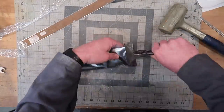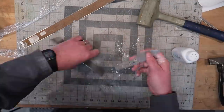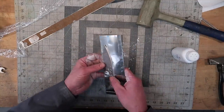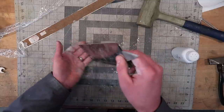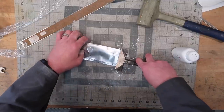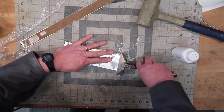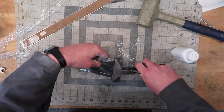Steels like Nitro-V can actually weld the envelope right to the blade steel, and that's obviously not something we want. We'll make our little pouches, put both blades in, and then do a plate quench. Once they've soaked about 20 minutes, with the kiln at 1950°F — though when I put these in the temperature will drop to around 1700-1800°F and take a while to come back — we'll let them soak for about 15 minutes at 1950°F and then throw them in the plate quench.